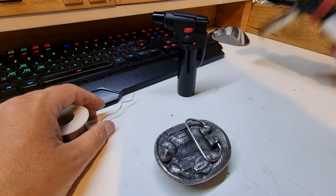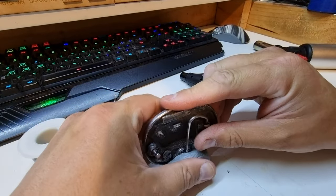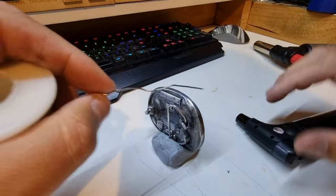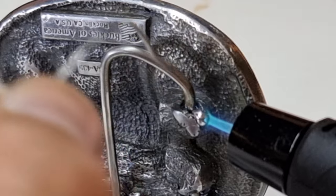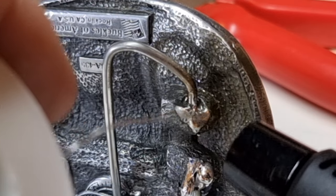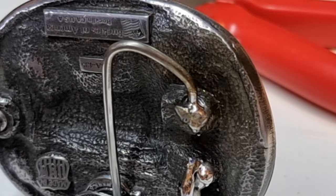I have a couple of torches at disposal — I've got the stoner torch and I've got the big one. This will undoubtedly cause damage, but this one might be just enough flame to do what we want to do. I'm going to use a piece of Blu-Tac here and try again. I'm thinking I might almost try this off camera, largely because I don't want the distraction of messing it up. Let's see if we can wick some solder into here and actually get it to bond — hopefully we'll notice when it sucks in and starts to bond with the pewter. The problem with these torches is once they get too hot, the tube gets a bit constricted inside and they stop letting gas through. I'm going to let that sit for a bit.